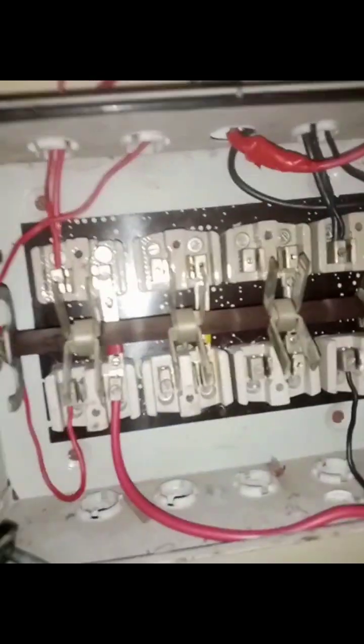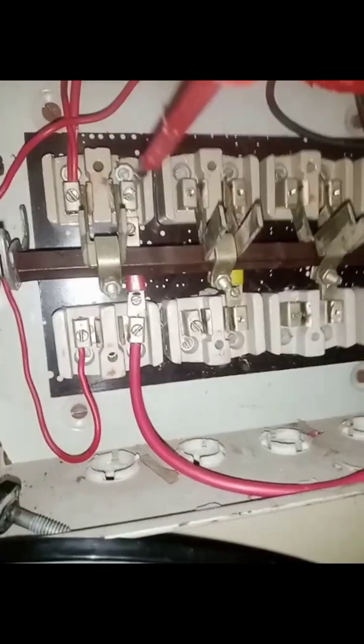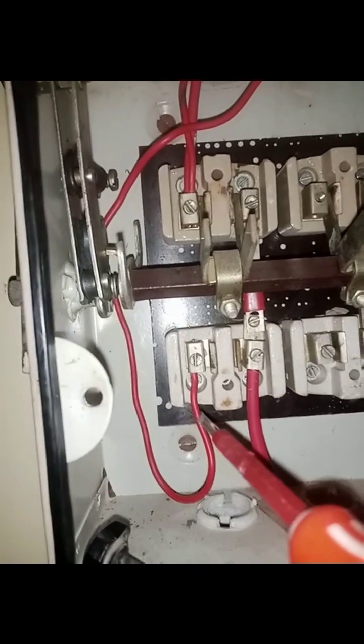From this side of the changeover it has been looped to this side and this side. Now what it means is that if electricity is restored, you will see these two mounts connecting together, running through the load cable. You can see that this has connected to this, and now the electricity can flow from this side through this side, thereby disconnecting the inverter output.